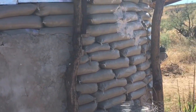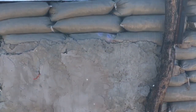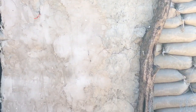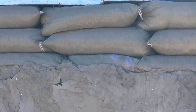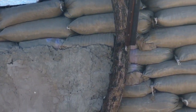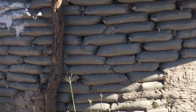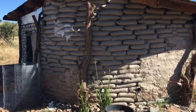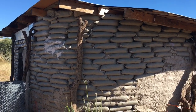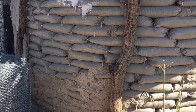A lot of people said lime, and lime is still in the running, but what I found from my own experiment was that stucco works the best by far — compared to cob, lime plaster, or lime mixed with cob. This is what the stucco looks like now. The reason this is significant is because this thing has been through monsoon season. If you've been following the channel, this thing actually got flooded before I even put the wall in, so it got hammered by rain.